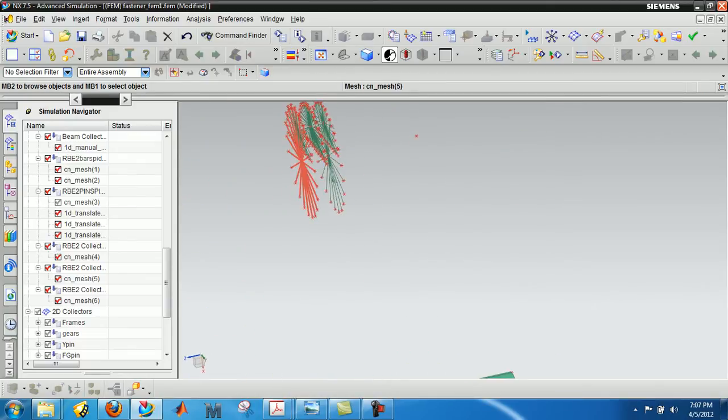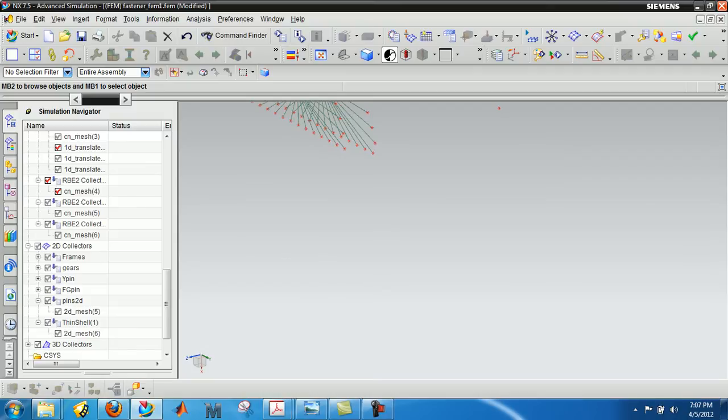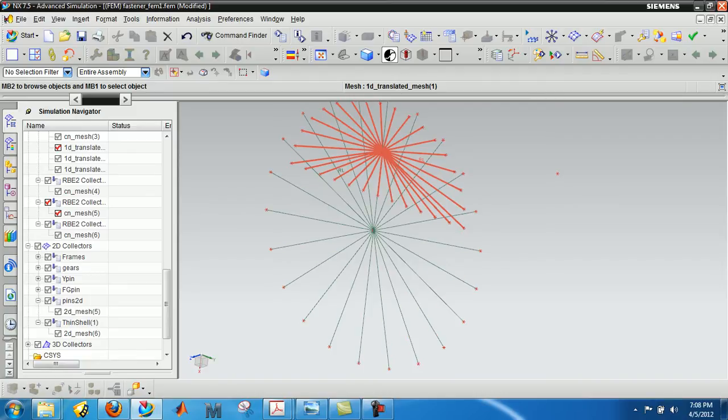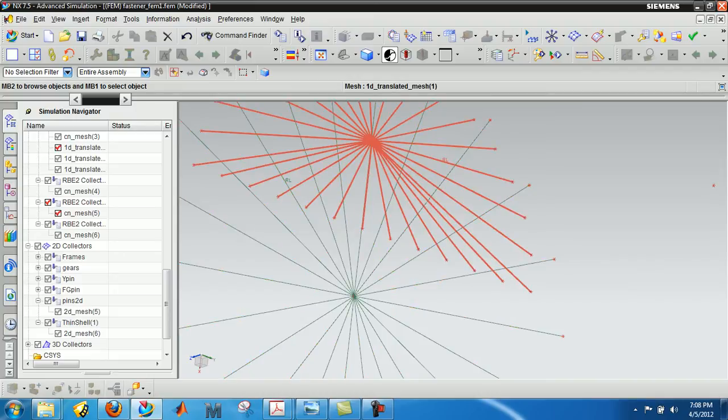The answer is no, because we have two different spiders — this top one for the pin and this top one for the big frame, but nothing in between the two. We want a physical relationship to exist between these two nodes. We want the big frame spider to rotate around the center relative to the pins. So what we're going to do is weld these two together, but instead of having one node at the center, we're going to have two. One node remains attached to the spider, but the duplicate node — at the identical location — actually spiders out to this other spider.